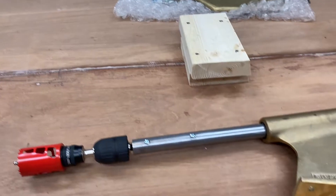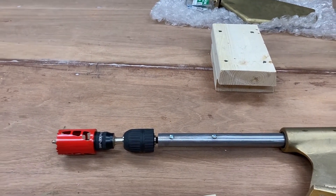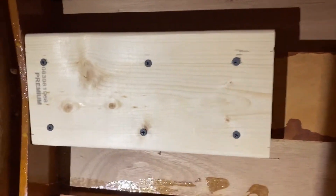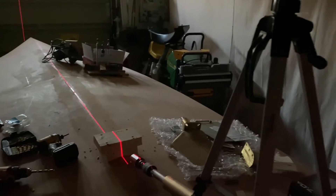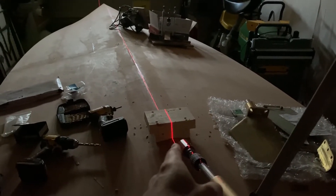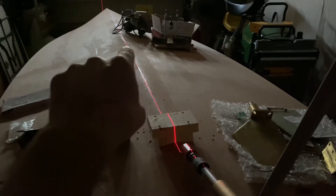I'm going to put this right underneath, looks like starting here right at frame and going back, so I'll screw this up under there and that will help with tearout as the bit goes down through the bottom side of the keel and breaks through. There's the blocking member just behind frame two underneath the boat. When the hole saw comes through it should come through somewhere in here. I'm using my laser level to mark the centerline on the drill block where I'll be drilling, to get that surface for the hole saw to go into.